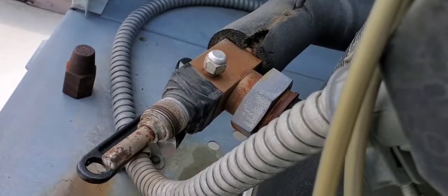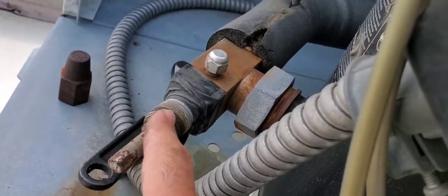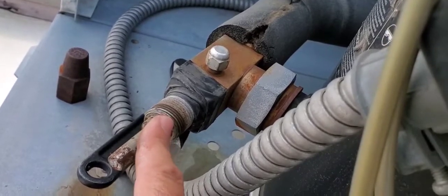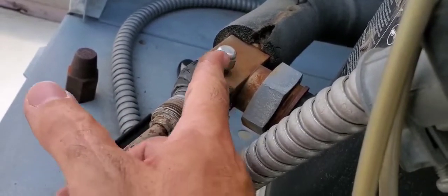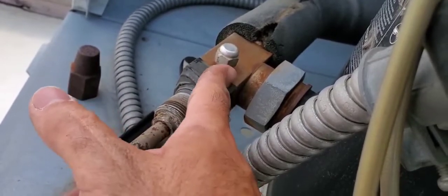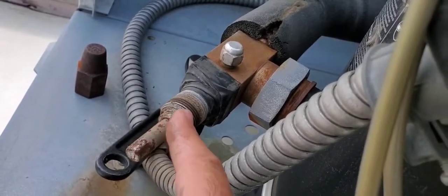So one area of a system I find leaks quite often is this valve assembly here with the stem on it. Now, right here, this packing gland, it usually leaks around here, but if we tighten that back up, it's usually not a problem. Where we stick our gauges or our smart probes, this service port right here, there's no threads in this particular fitting to put a Schrader core in. So these leak quite a bit, especially if this stem cannot seat properly when it's fully back seated.